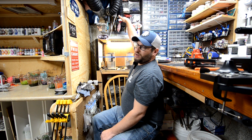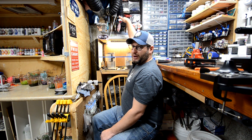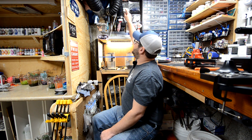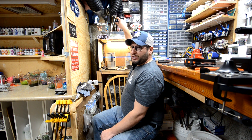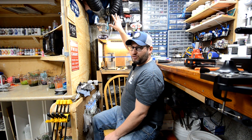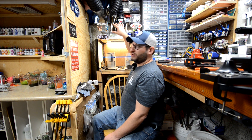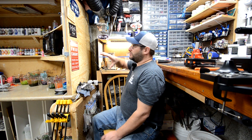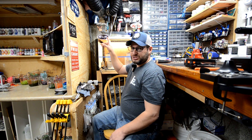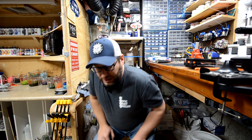It's 195 CFM, a four-inch plastic fan — and if you can find a metal one, that might be better, but I'll put this one in the description. A four-inch flexible pipe with a diverter. You don't actually need the diverter or check valve if you're only running one tube outside the house — you just need one to let it go outside. And I'll put a note in there probably for the little cap you'd need to put it outside. It will require some work; you've got to drill holes.